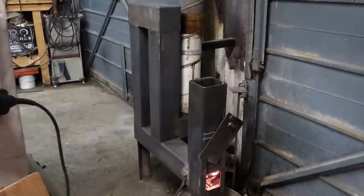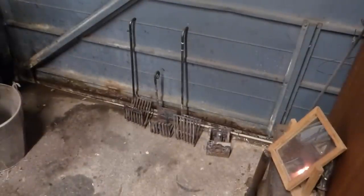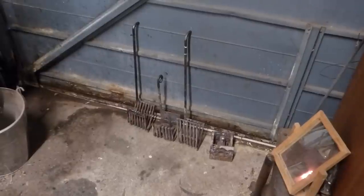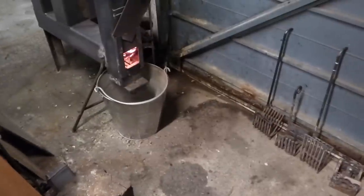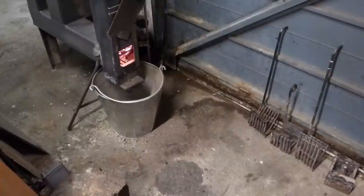The fire baskets — I've had to make them, and you can see I've experimented with a few just down there. They're all different measurements. The first one I had was 8mm, the second one 6mm, and the last one that's actually running in the fire is a 4mm gap. I found with the 4mm gap and a 20mm gap underneath, the fire runs really nice.